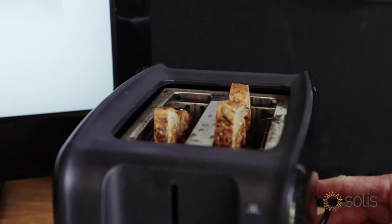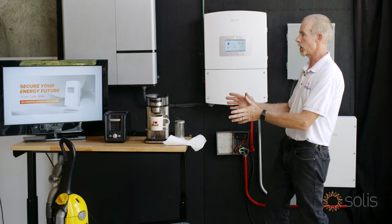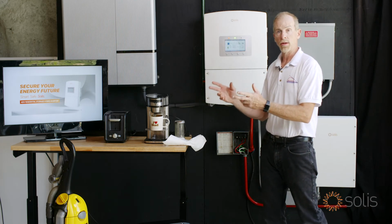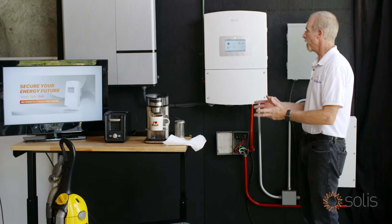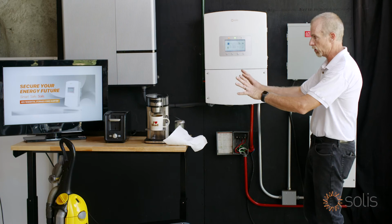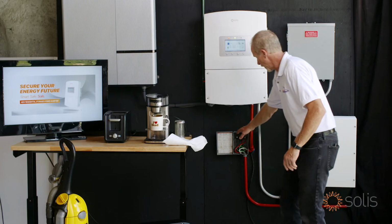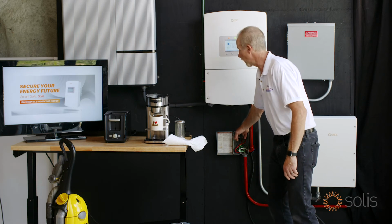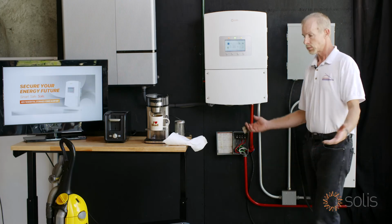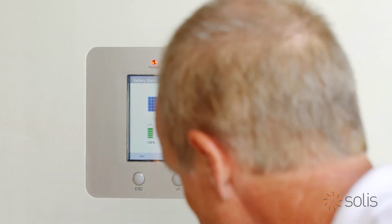Okay, this is great. We showed that the electrical circuits are working, backup circuits are working, but this is where it gets even more interesting. We got to kill the utility power. So all that was to show that the circuits are working, all of our loads are working. You can see the screen there. Got our fan working. Here's utility power here. So what I'm going to do is I'm going to pull this. Everything's switched over. Now we're operating on backup power.